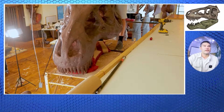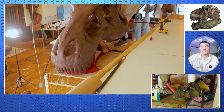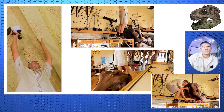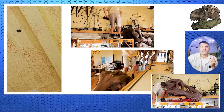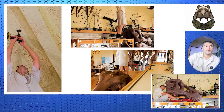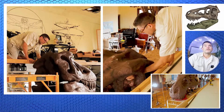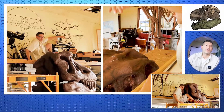Here we previously threaded some half-inch black pipe, which currently it looks like I'm finally able to screw onto the flange on the ceiling. Now we're finally maybe going to try to raise the skull. The flange is holding onto the ceiling. I found a piece of wood, but I can only insert about two of the three screws. I figure maybe it could hold up a couple hundred pounds, and by my estimation the skull is about 50 pounds or so. So it's not super sturdy, but it should be enough — a nice solution to installing the skull.